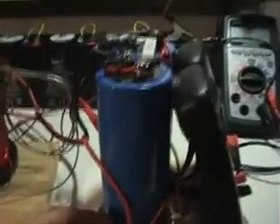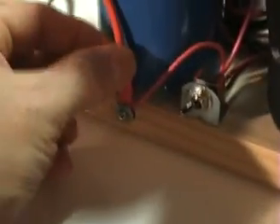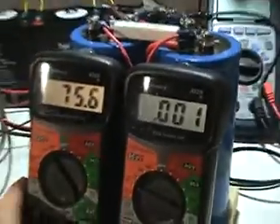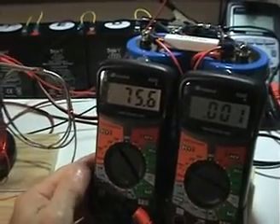This is the complete circuit and meter combination — it can be lifted as one unit, nothing falls apart, solid connections. I can carry it and test pulse circuits without worrying about errors. The positive lead goes through a double-pole double-throw switch, which gives me the ability to switch the circuit off. As you can see right now, there is no voltage measured across the resistor because it's going directly from the batteries.